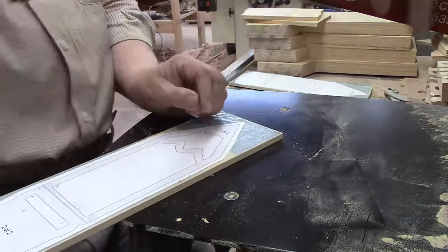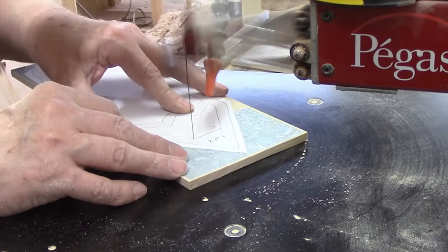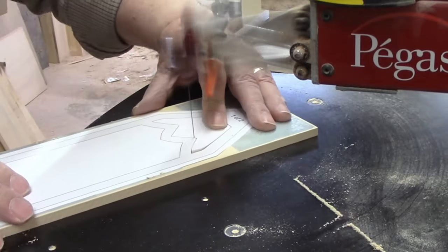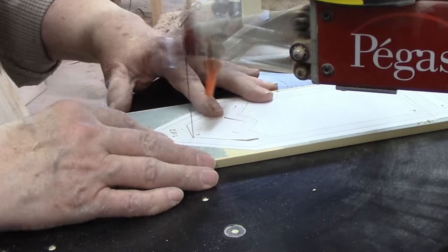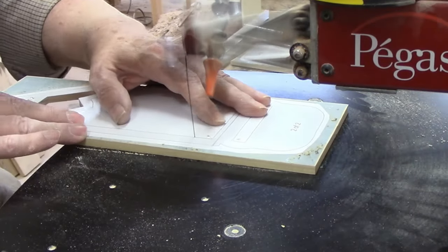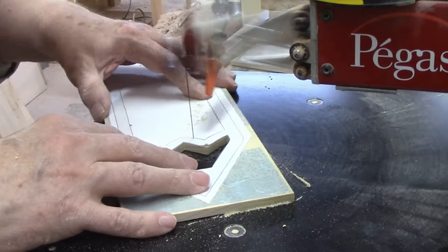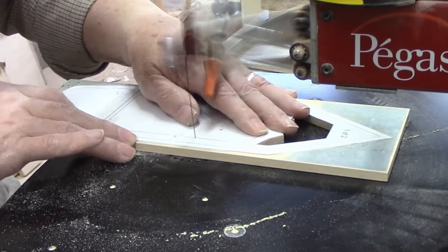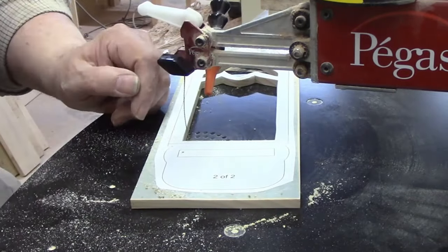The top half of the pencil seemed like the next logical part to cut. I taped the back half containing the eraser to the pencil front part before attaching the pattern to the wood. As usual, I drilled pilot holes and made the interior cuts first. The detail that made this cut a little tricky was its length — when making the long cuts down the side, a good amount of the board hangs out over the front edge of the scroll saw table. I started at the front part of the pencil and cut from the pilot hole to the nearest corner, making corners by easing off on the blade, swiveling the workpiece, and then feeding the wood into the blade once again. Those little sawtooth shapes are cut in the same manner as corners.